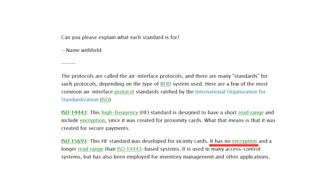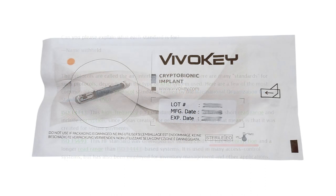Encrypted data, or the use of encryption, is clearly an application-level function. RFID standards have to do with data transmission and the protocols used to do that — not necessarily what the data is or whether it's encrypted. For example, the advanced VivoKey Spark is an ISO 15693 device that uses AES 128-bit encryption and actually performs cryptography in the chip. The data passed between it and the reader during an encryption challenge has nothing to do with the standard across which that data flows.